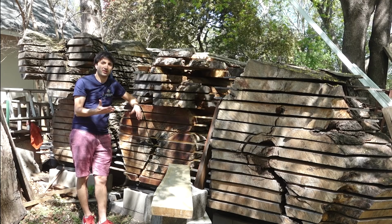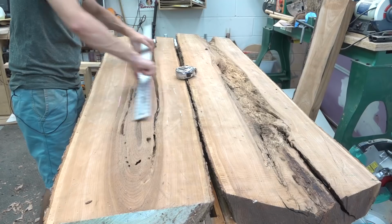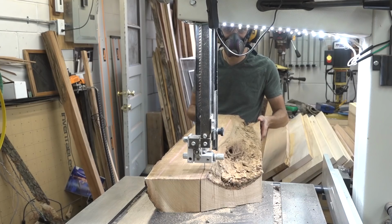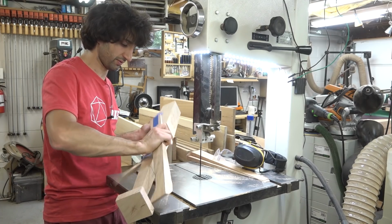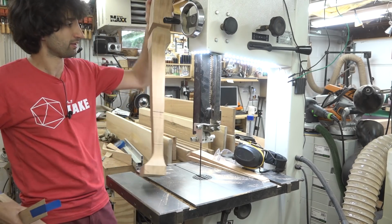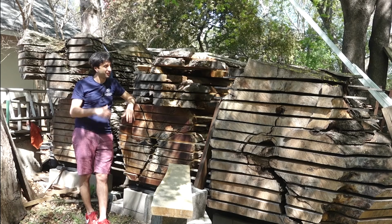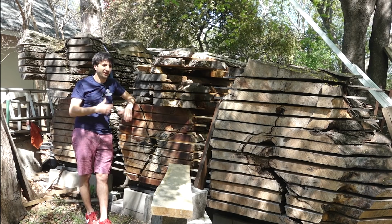So a hollow log or a rotted out log like this one works out really well for a furniture maker for leg stock. So back when I built the Highboy, the cabriole legs came out of a hollowed out log. That was a cherry log that I had sawn and saved years ago for the exact purpose of having square stock for legs. So a rotted out or a hollow log is still useful for things like square stock and small project parts and that kind of thing.